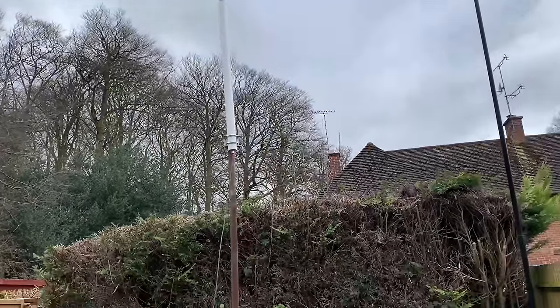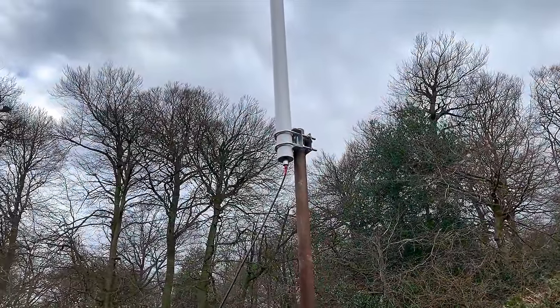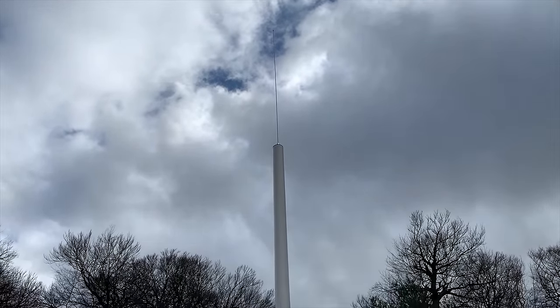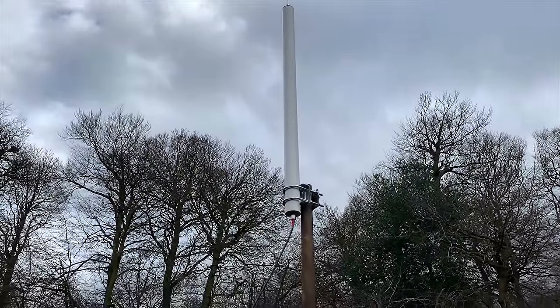This antenna has internal loaded wire traps which act as a great alternative to a long wire. It's ideal for those that want to listen to shortwave but have limited space. This antenna is easy to build and install. The two main parts are the white base area which covers the loading coils, and then you have a whip which simply attaches to the top with a little grub screw.